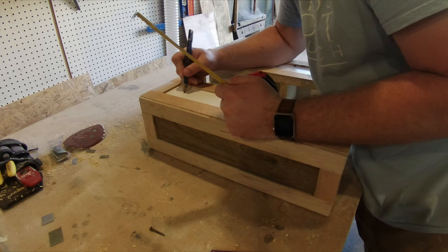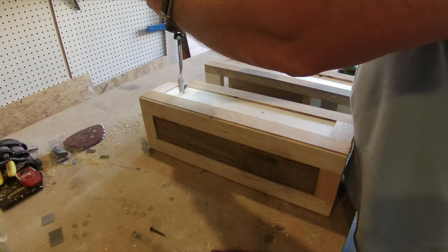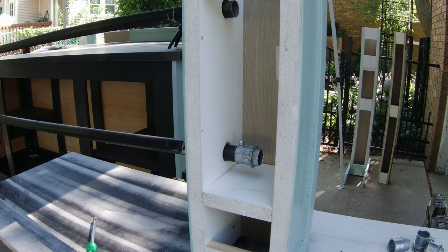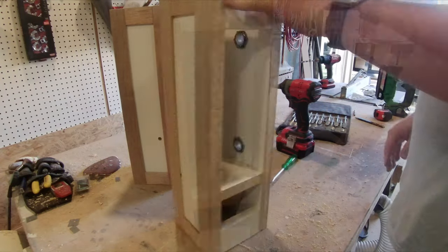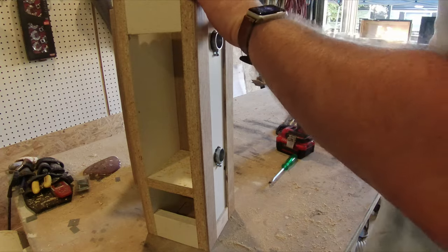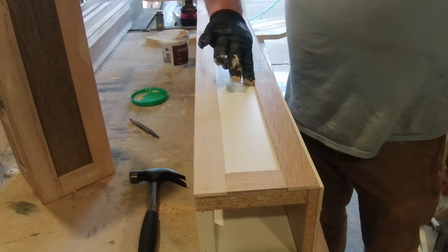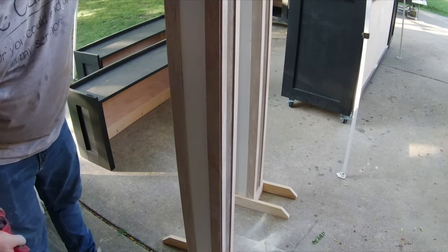I went ahead and drilled some holes in the toppers so we'd be able to put two poles in there. I used three-quarter inch conduit, but that was going to end up biting me later — you'll see why when we get there. I used conduit connectors basically as caps so that once they went through the hole I could attach them and keep them from falling out of the box. I let them be kind of loose so there'd be a little bit of play in case the wind blew. Then I went back through all the countersunk holes and filled them up and sanded them down so everything would be smooth.